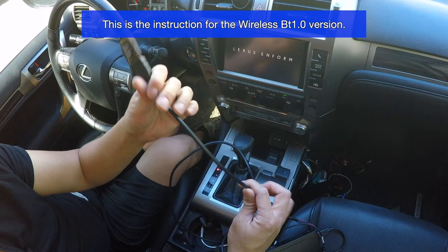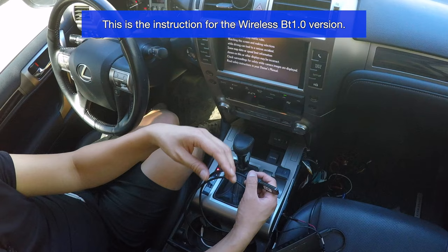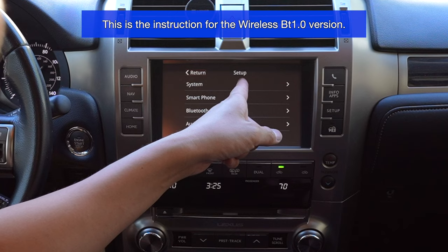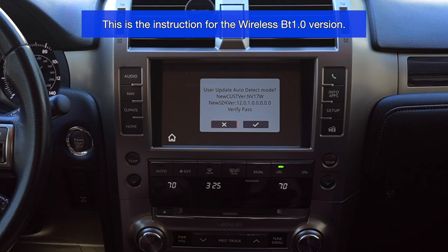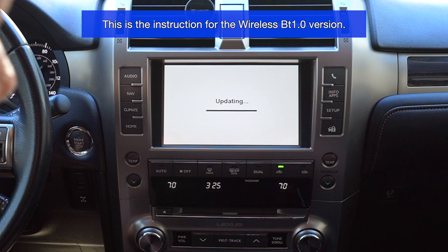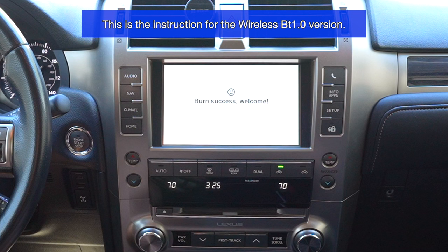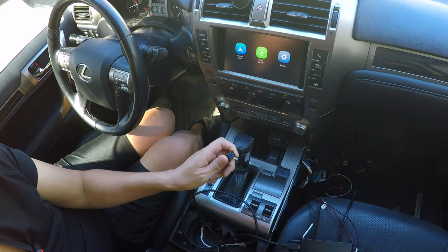Turn off your car and turn it back on. For future firmware updates after upgrading to the new system, go to your CarPlay screen, go to Settings, then System, then Firmware Update / System Update, and press the arrow button to update. This only works once you've upgraded to the new system. If you still have the older system, you cannot use this step — you have to press the UPG button on the box itself, which means going back to the shop if it was installed there.